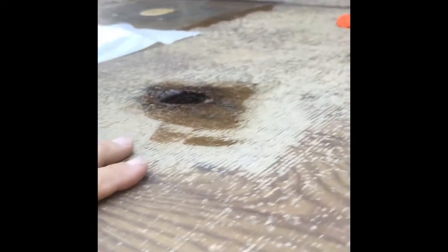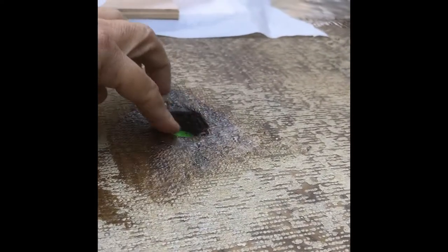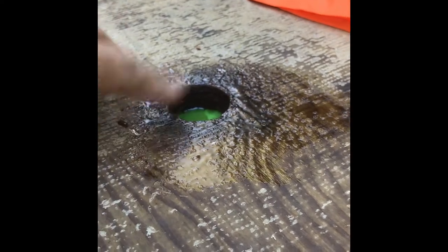This is going to be a striper and crappie fishing boat. I've ordered a couple of seats but didn't want any bases in there — I want a smooth deck so I can move around and fish on top. I'm still going to keep the live well in this corner. You can see where I took some resin and sealed that up really good. Same thing right here where the water comes in and where the drain plug and aerator are. I'm going through and sealing holes that are going to stay, working the resin in with a brush, and I'm going to mop this whole deck before I put the carpet on.